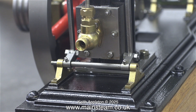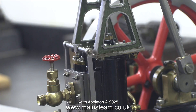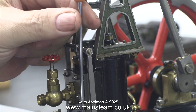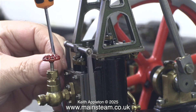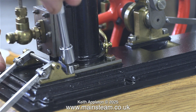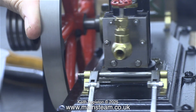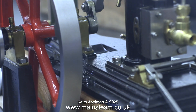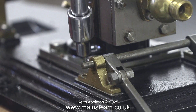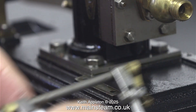The first thing to do is to remove the valve gear entirely, including the gunmetal mountings. Here I'm undoing the nuts on the end of the cross shaft that moves the valve rod. Now with my very small, thin screwdriver, I'm removing the 7BA grub screws. Once I undid the bolts holding the bearing in place, everything was able to be taken off and sat on the bench. I have a socket which is just the right external diameter for this job — sometimes I machine the external diameter to make it smaller so that it fits, but this one's okay.